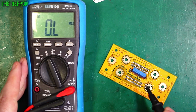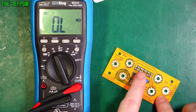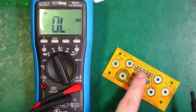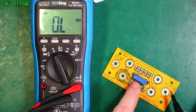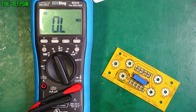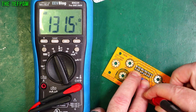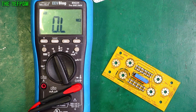I've got the 200K trimmer which I used yesterday on the other board — the one I designed this board with. I've put in all of the values as they should be, including this trimmer, which I've adjusted all the way down to one end to give the highest resistance, meaning it has the least effect on the circuit. Re-measuring now: getting 131.5K, which is 1K higher. So that gives me about 1K up and 1K down from my target — which is what I designed it to be in the middle of the range. I think the 200K pot is going to be fine.